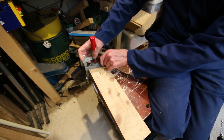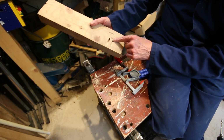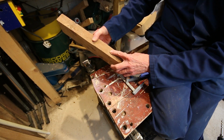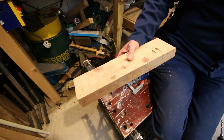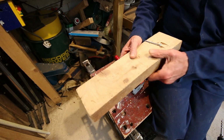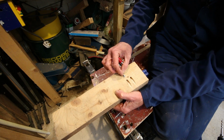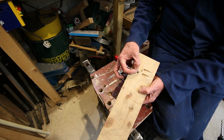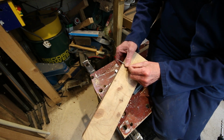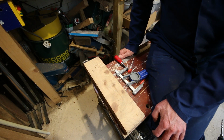And just take that off, and you'll see that the holes are nice pocket holes about halfway through. Of course, they don't come through at this end, but they will allow the screws enough depth so that they get driven through properly, because with the bottom of the hole about there, if I use these included screws, it's going to be about an inch and a half out the other side. I'm going to stick with those. I've got enough. I only need 4 holes.